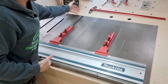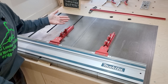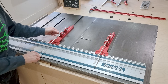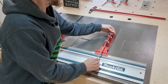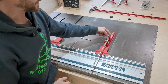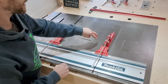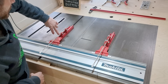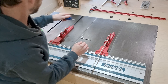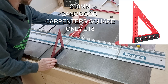Now I've done that, I only need to do thin rips so the next thing is to calibrate with the bar, then use the bar to do our thin rips. Release the nut, slide the rod through the front, do the same with the other one, and put the nut on the end. Nip up the plastic tip and the rod, slide it all the way until it hits the back of the stopper, then nip up the back stopper. Do the same to the other one.